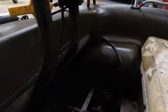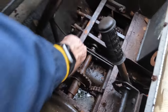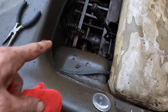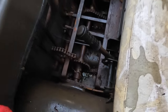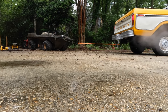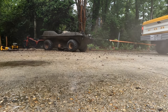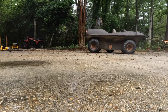Now that we've got the front kind of cleaned up, I think this is the reason we're not spinning — the chain's broken and bound up. I'm going to try to rock it backwards, push and pull it, to see if I can get that chain to free up and get past this sprocket. Let's see if we can do that. Okay — all six of them, well three of them on this side, are moving.